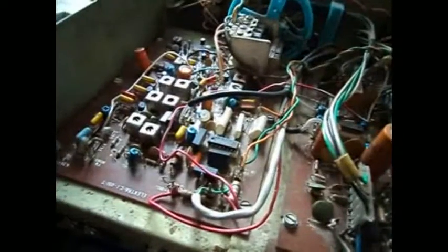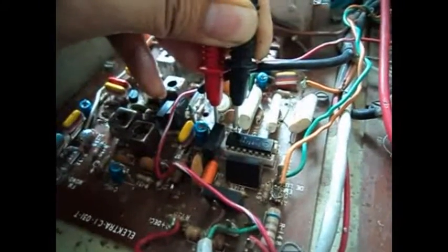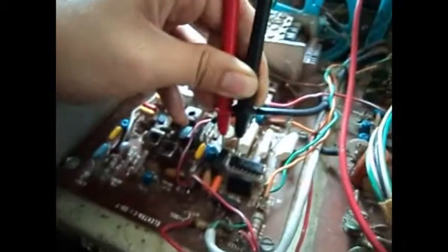So this time we're going to see if we can fix the multiplex on the radio — that would be the last thing to fix in this thing. Here you can see what I'm talking about. I'm measuring across that connection which should be perfect continuity, and you see it measures right now down to 4.5 ohms — but still a bad connection.